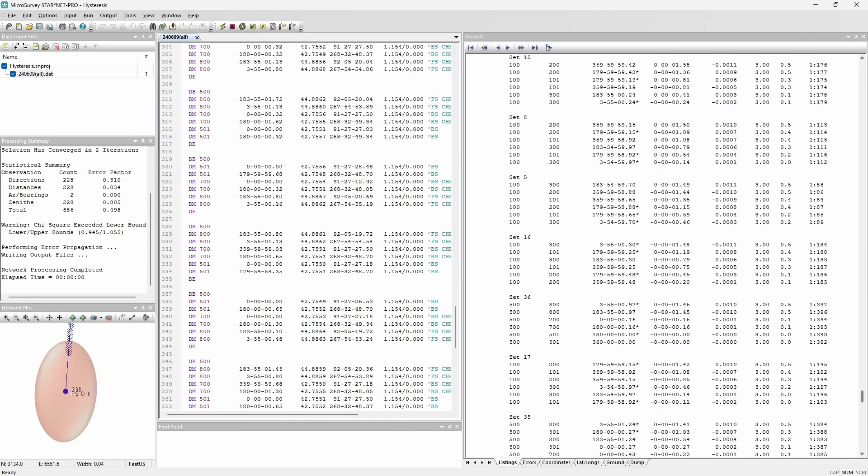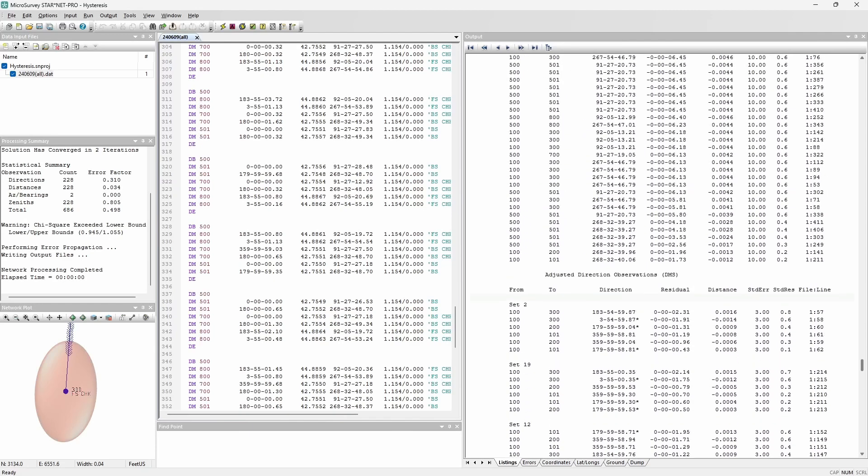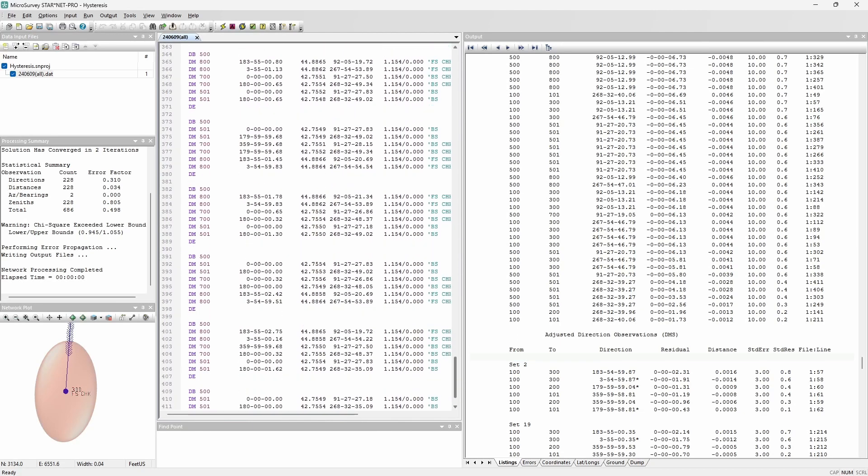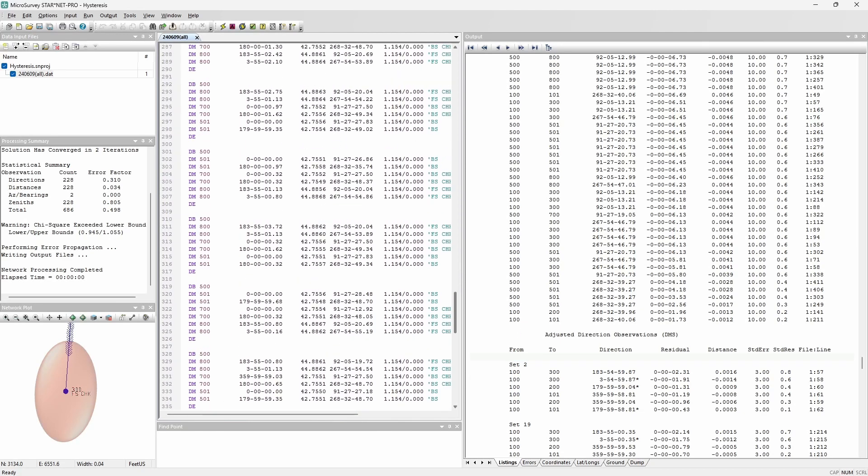This would represent a tripod not properly adjusted, but the level of slop in the tripod was by no means worse than what could be possible by neglecting to pay attention to the tripod fastener tension. After I crunched the numbers and compared the residuals of the angle measurements from the data set with the tripod properly tightened to the residuals when the tripod head was loose, there was a measurable difference, but it was quite a bit smaller than what I was expecting to see, to be honest.